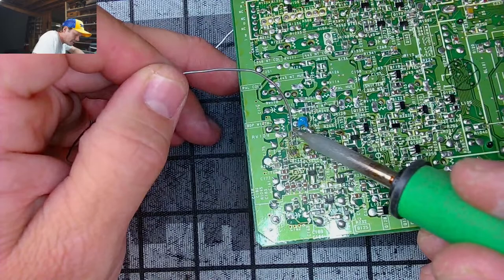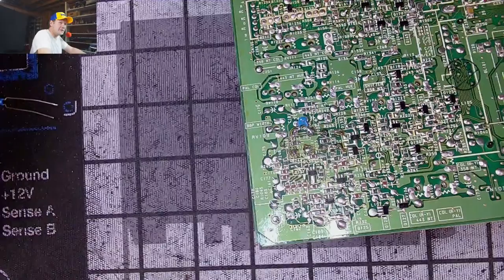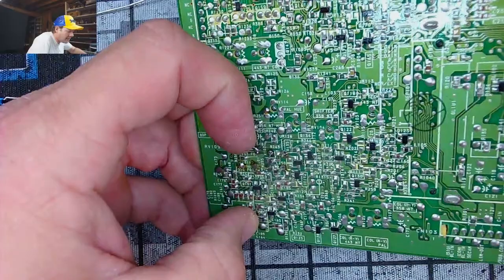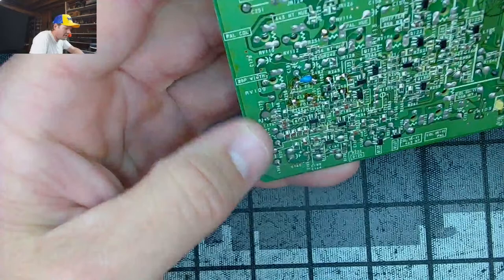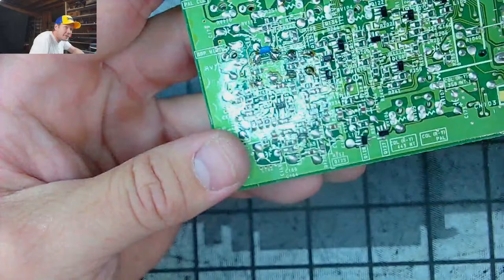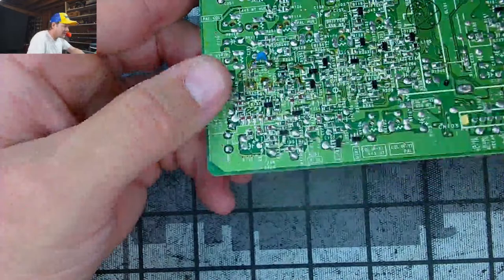Okay, there we go. So that's the first one of those capacitors installed. Look at that. I'm going to clean that up in a second, but see how it's just between the two points on that part I just installed. I can bend that out of the way a little bit to make sure nothing behind it's bridging. And it looks good. We'll put some stuff right in here, I'll show you in a minute, to make sure that doesn't touch. Just some insulation and goop there.